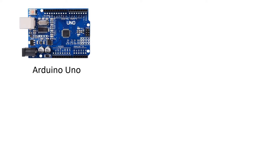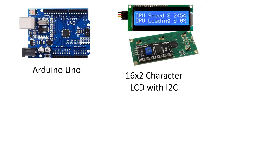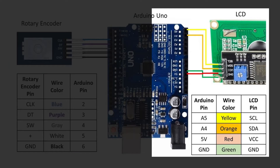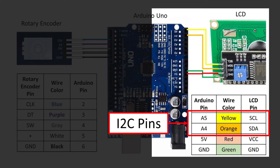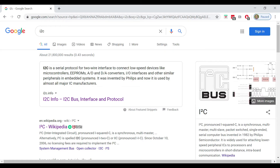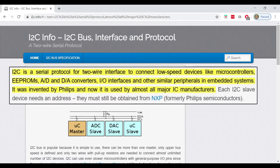Welcome back! At this point, you should have received the parts: an Arduino Uno, an LCD with an I2C interface, rotary encoder, the scrubber knob, and some jumper wires. Now we will put everything together. Refer to this diagram. The LCD is powered through the 5-volt and ground pins. The clock pin, or SCL, connects to pin A5 on the Arduino Uno, and the data pin, or SDA, connects to A4. A4 and A5 are also the I2C pins on the Uno. If you are not familiar with I2C, I would suggest a Google search. In short, I2C is a protocol that allows devices to talk with each other using just two wires.